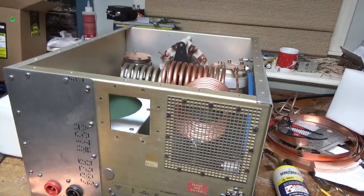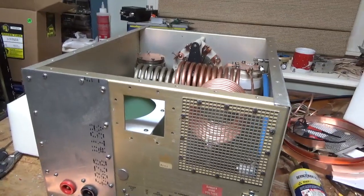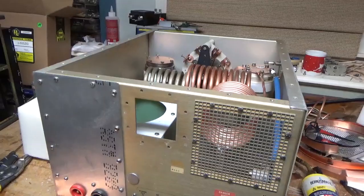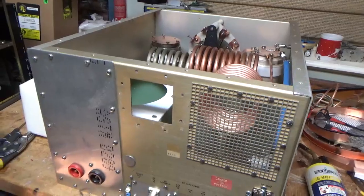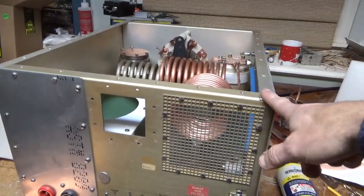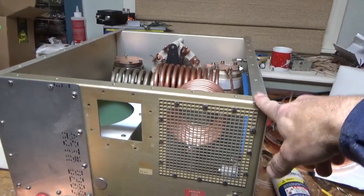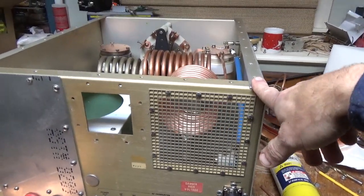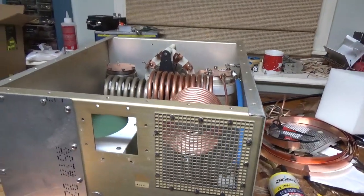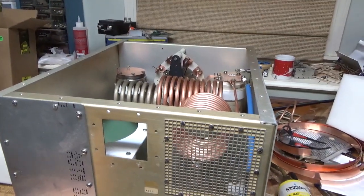There's big, and then there's just way too big. If you're going to throttle it back, you're just wasting a ton of electricity. The efficiency at best is around 65%, and if you're going to run it throttled back to like an eighth of what it's capable of doing, the efficiency is going to go straight down the toilet. I've seen a lot of people make monoband amps, and this is the real test — multiband. I wanted to show I could do it. A couple other guys tried it; one passed away, and another guy used roller inductors which were undersized. An amp with that kind of power with a 20-amp inductor, trying to use it on a high-duty cycle or on the higher bands — it's going to fail. It's a lot easier to put in a roller and tapped coil than a fixed tapped coil.